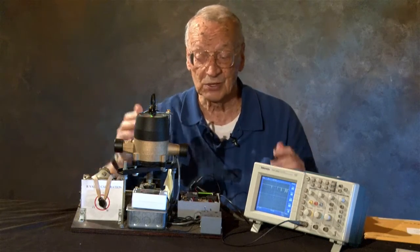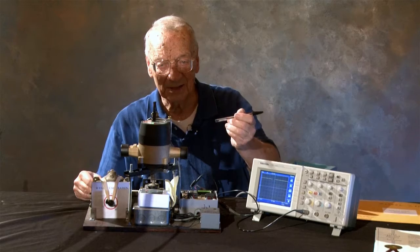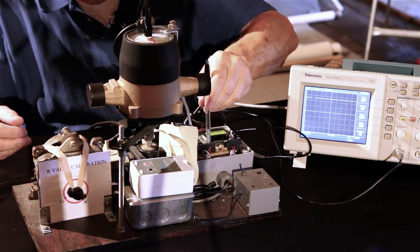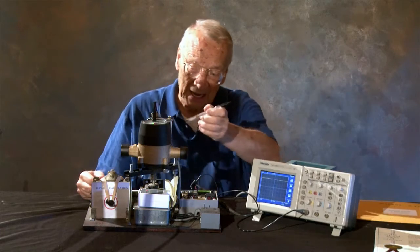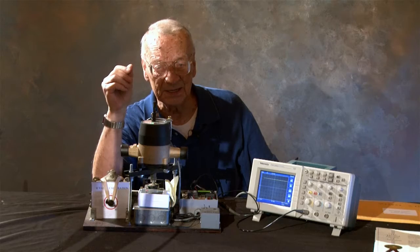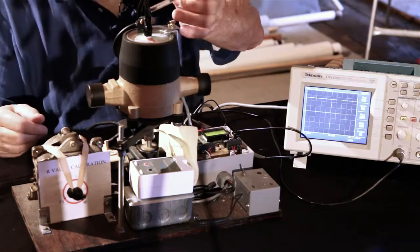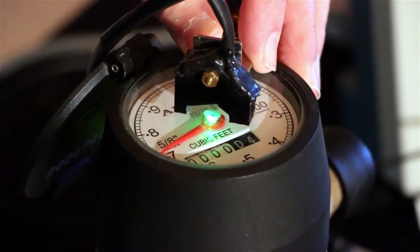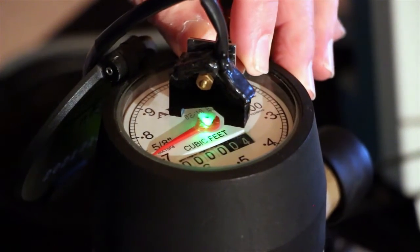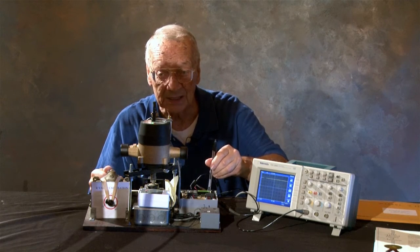There's no plumbing required here to do this. It's a clamp-on — adjust and you're in business. The actual invention consists of this optical sensor here and the printed circuit board with the microprocessor. The optical sensor consists of a high-powered green LED operating at very, very low current, less than one milliamp. The pickup feeds into the microprocessor, which has an A-to-D converter that converts the signal to digital, and then the software displays what's happening on the liquid crystal display.